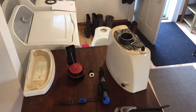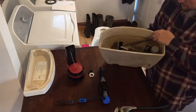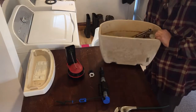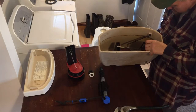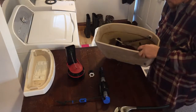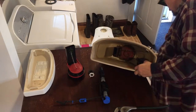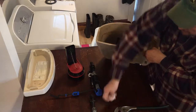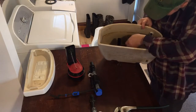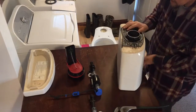In this video we're going to attempt to rebuild this toilet. First of all, we've got to take out this old flush valve. There's the old flush valve — that'll be the new one. Unhook the chain from the handle, then see if we can get this nut off.